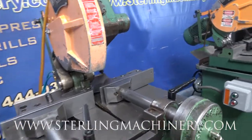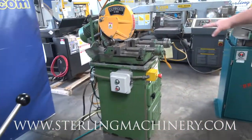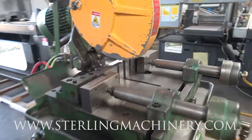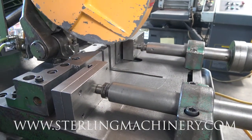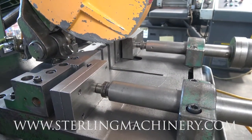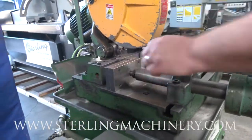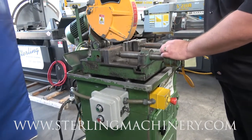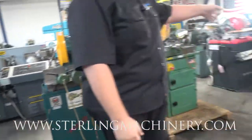And you can go to your next step. Again, manual vise, air vises. You see, as soon as you pull it down, it only has to go a little bit just to get your piece in there. You're already gonna have them all set up from your basic setup right here on your main vise part. You're just shoving your piece down, closing it in, pulling the saw down, and go on to your next step.